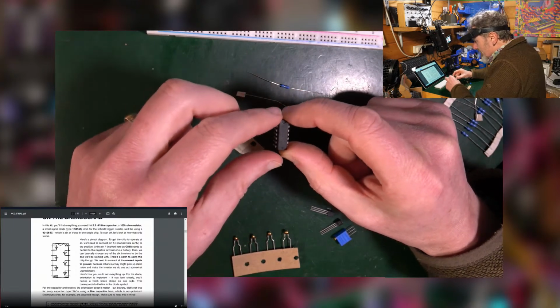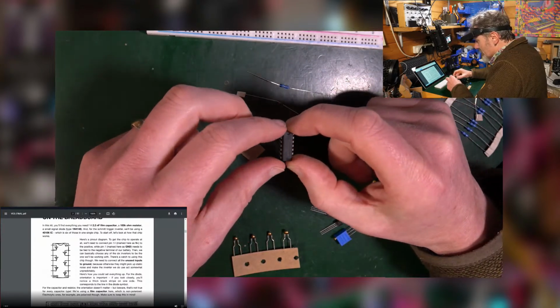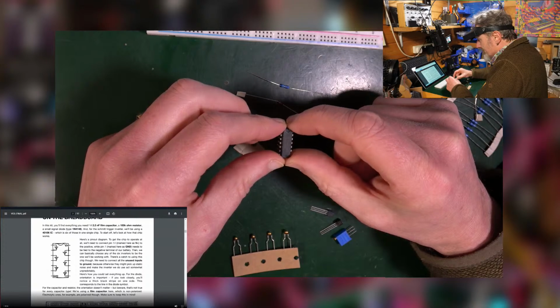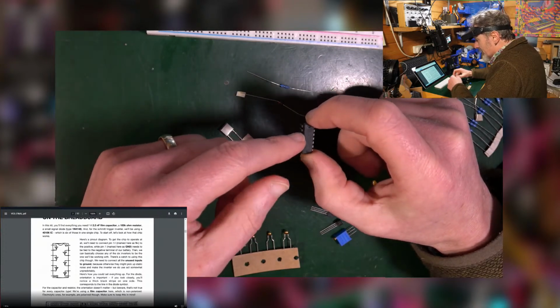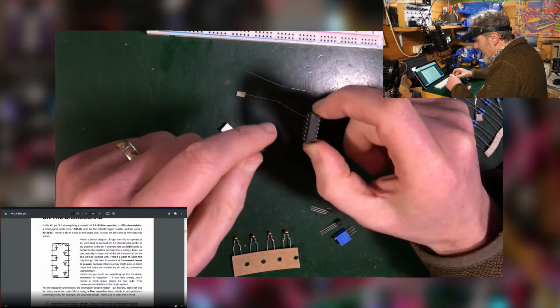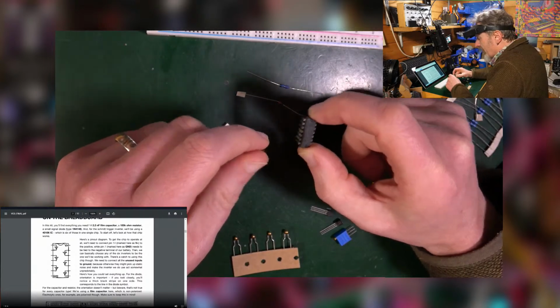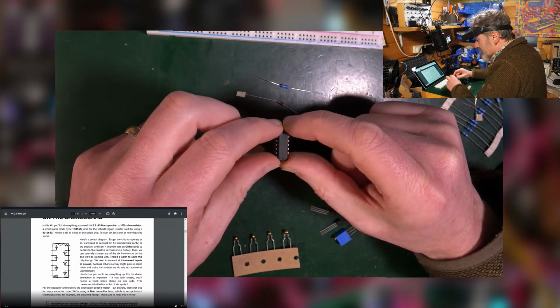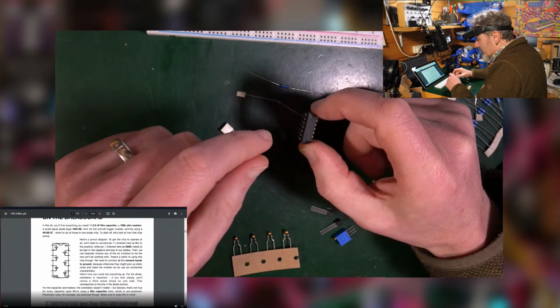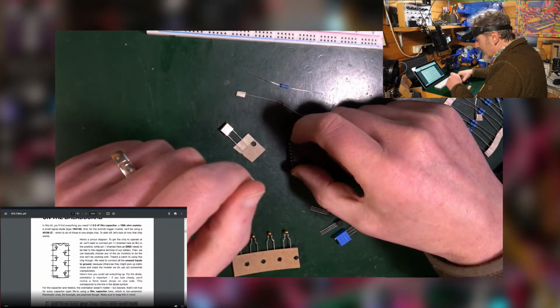Okay, so pin 14 needs to go to the positive, while pin 7 needs to be tied to the negative terminal of our battery. And then we can choose any of the 6 inverters to be the one we're working with. There's a catch though. We need to connect all the unused inputs to ground, otherwise they might pick up static noise and make the inverter we use act somewhat unpredictably. Okay, so here's how you could set everything up.